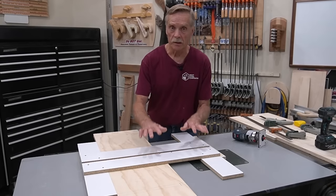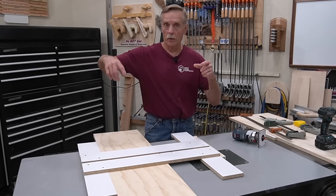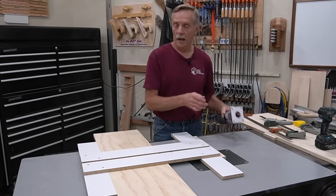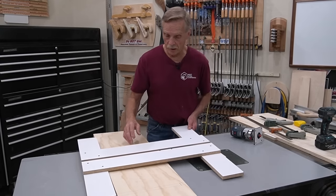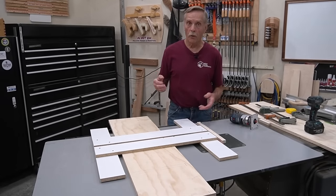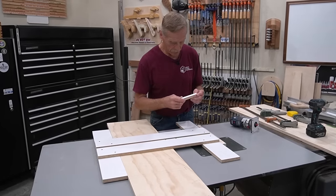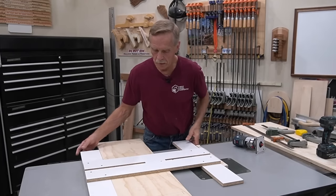This fixture is not adjustable, but it's so quick and simple to make that in my opinion it's not worth the time or effort to make an adjustable version. With the fixture, the router moves across the workpiece instead of moving the workpiece across the router — a big difference you might not appreciate until you see it work, especially if you've used other methods. One more attribute is that it's very simple to make stopped dados with it, which is what I need for this project, starting with a little piece of scrap material cut to the exact width of the slot.